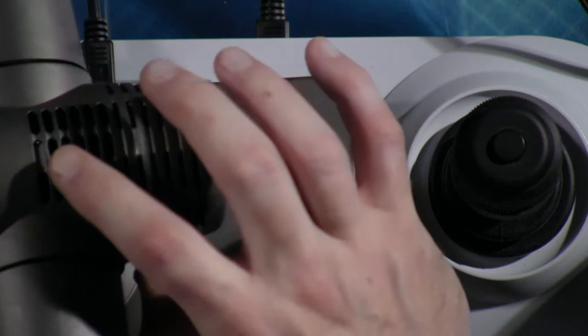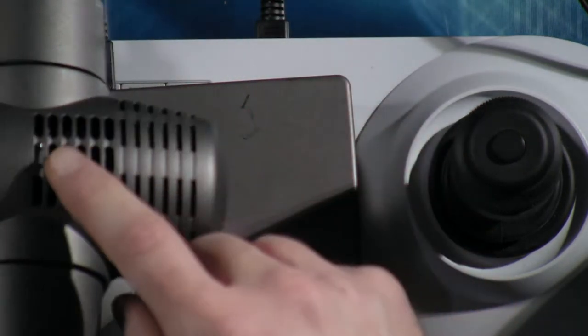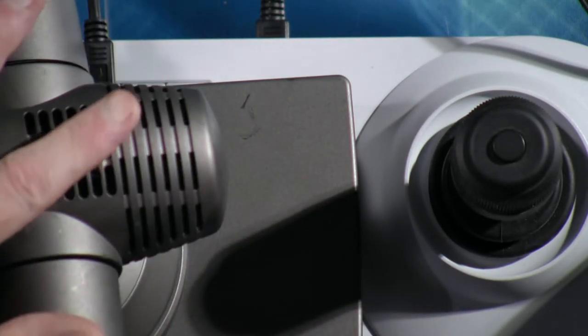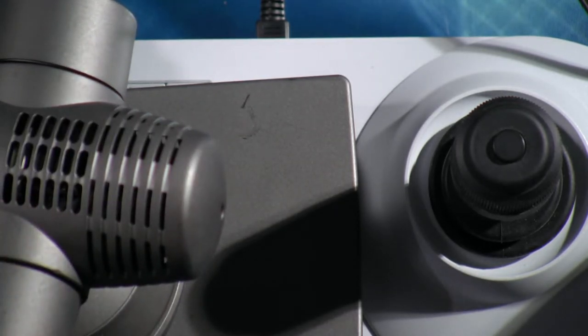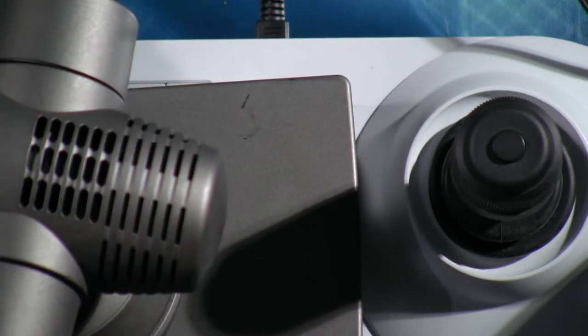And so you can just use that thermal tape and put an aluminum heat sink on top of that, and it'll run 24/7 with a decent size heat sink, and you don't have to worry about this fan. But like I said, sometimes you can get a fan that's kind of noisy on these guys, especially since they're getting older. But every single one that I've got works perfect, and the color's perfect, so there's no problem in that area.